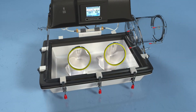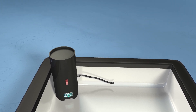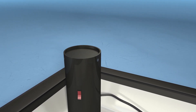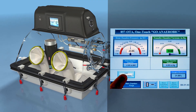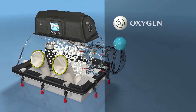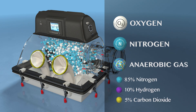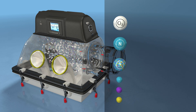To operate, turn on the catalyst heater unit and place the thermocouple away from the heater. The heater temperature is factory set. Allow 5 to 10 minutes for the heater to reach its set point, then place the palladium canister on top of the heater. During the Go Anaerobic operation, the first 4 purge cycles use nitrogen gas. After the 4th cycle, the PLC switches to anaerobic gas and will continue the purge sequence until oxygen levels are below 5 parts per million.